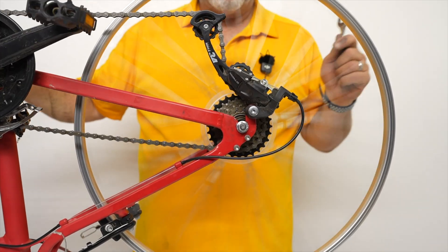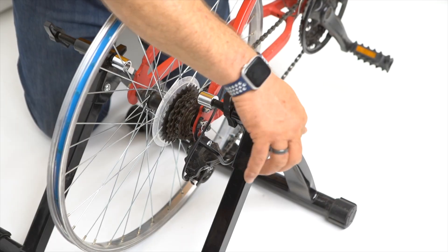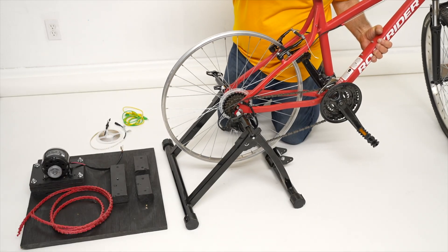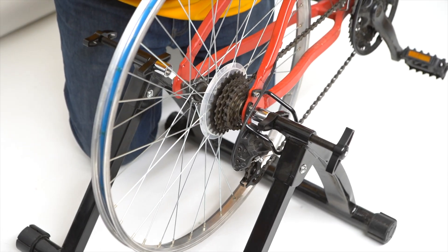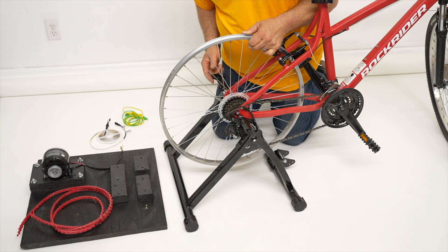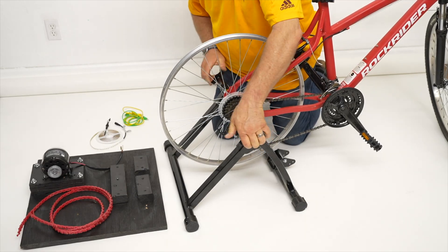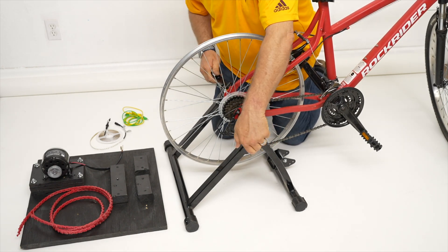Now we have a functioning installed wheel with no rubber showing. Open up these two pieces — first you want to put one bolt into the first cup, and you should have two people do this to make it a little easier. Put the second one in, tighten that up, then together just start tightening. You should go as far as you can physically tighten them — that's the safest route, as tight as you can with one hand, and then the locks.